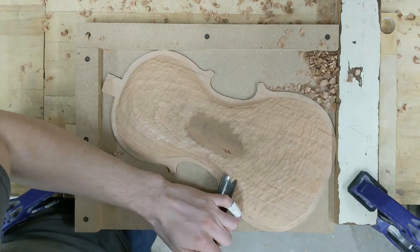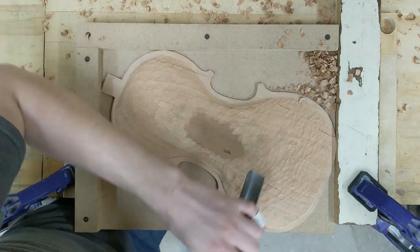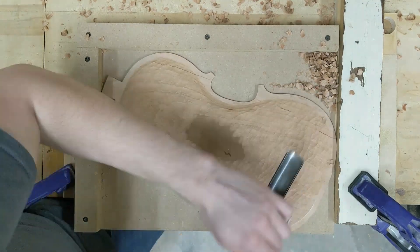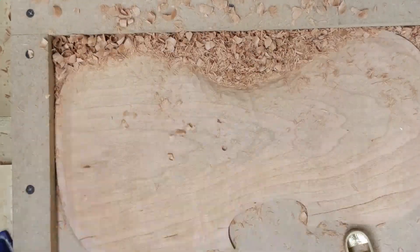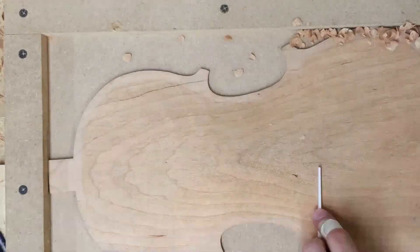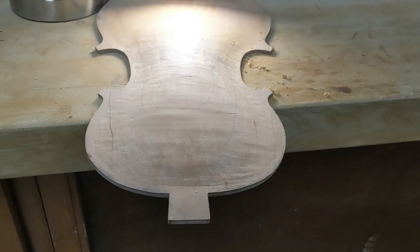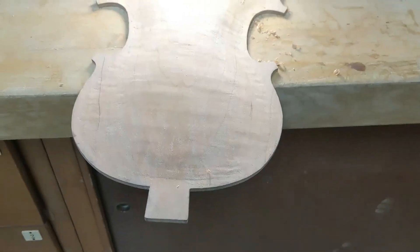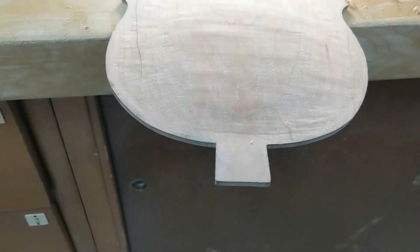This is where we really start to make progress. I was a few hours in at this point — I had started earlier in the day and I did the whole cherry back over the course of an evening and the next day, and my hand was destroyed by the end of it. Here's the time-lapse footage. I take it down and then start using the finger plane. Problem with the finger plane is, on the spruce I was able to go across the grain, but when I go across the grain with the finger plane on the cherry, the cherry's so hard it forms grooves that I can't undo. And my finger plane is too large to get into the C-bout, so I had to use a scraper on that. Now you can see the waviness — absolutely terrible — but a little bit of 80-grit sandpaper took that right out, and then some 100-grit smoothed it up. It did remove a lot of material, but the arching is still good. I check with the templates constantly.